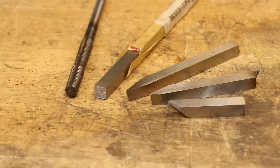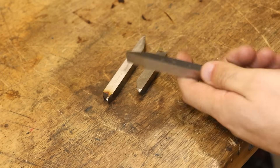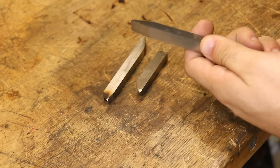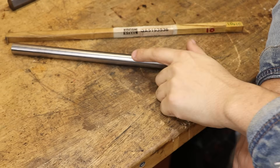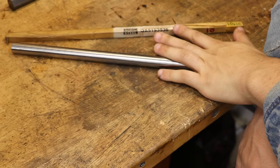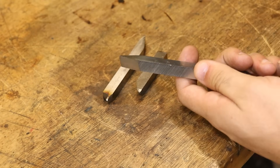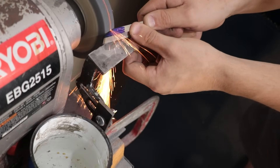To begin with, you need to heat high-speed steel to a much higher temperature — roughly 1200 degrees Celsius, which is about 500 more than you would for normal carbon steel. It also requires a pretty specific tempering process that would be difficult to do in a home workshop. I tried to replicate it myself and you just don't get the same toughness and hardness as a normal end mill. That's why I stick to easier tool steels such as W1 or O1, which are much easier to heat-treat and still produce very usable tools. Any high-speed steel I buy comes as blanks which I grind into shape — they're already hardened, and grinding won't affect the hardness.